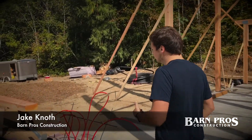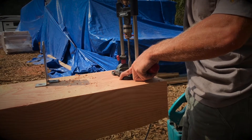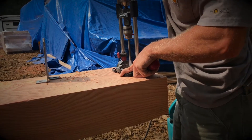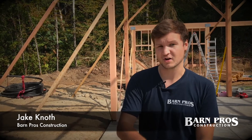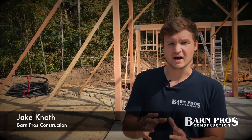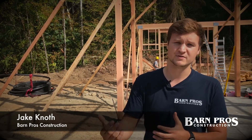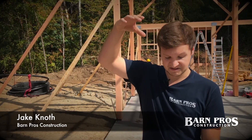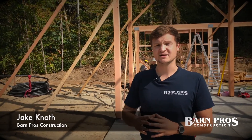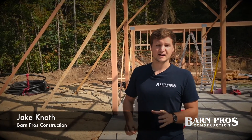To do that, we actually drill a hole into the top six inches or so of these posts — it's the part you're not going to need, it gets cut off. We use a long bolt that goes through that, chained off on either side. What this means is that the post, even if it's sitting on the ground, will always be locked in. Whereas with a chain, once you release the weight it begins to ease and you risk the post falling over. This allows us to have ultimate control and for the post to act as about a 30-foot plumb bob, so we have an easier time setting it onto its custom base below and getting it braced off for the next step.